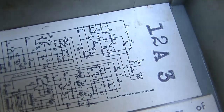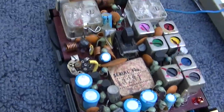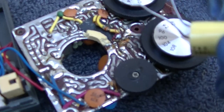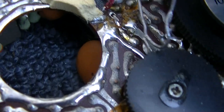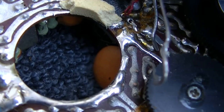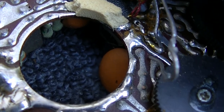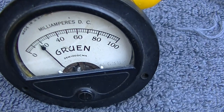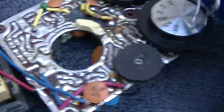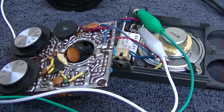But not to say any of these other ones are not open. Yeah, usually this one. Okay, that capacitor is these two leads right here. So obviously that one microfarad is trashed. Okay, that one capacitor has been changed.